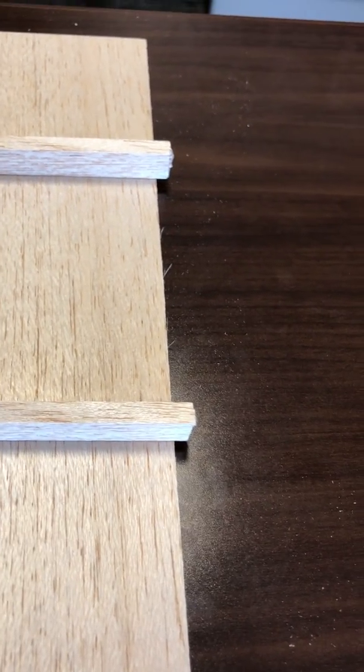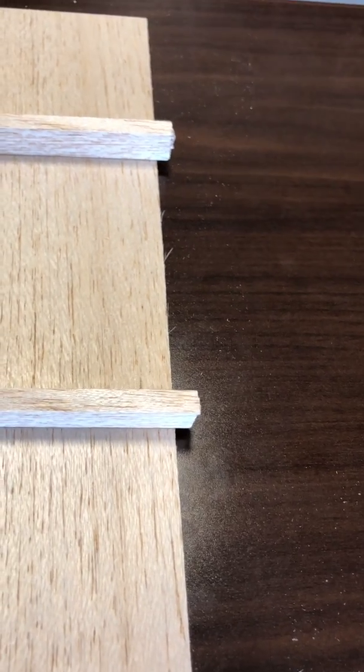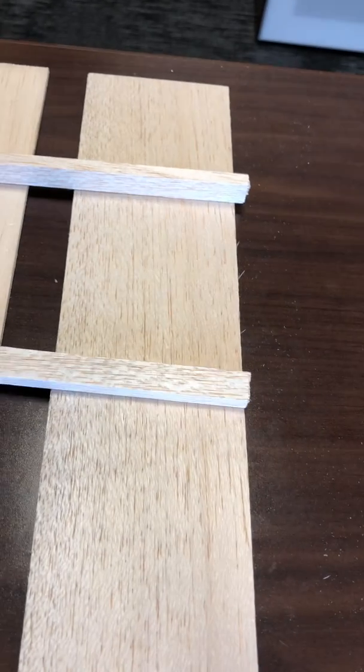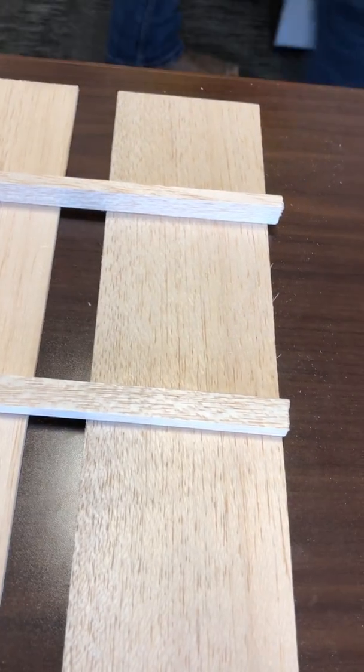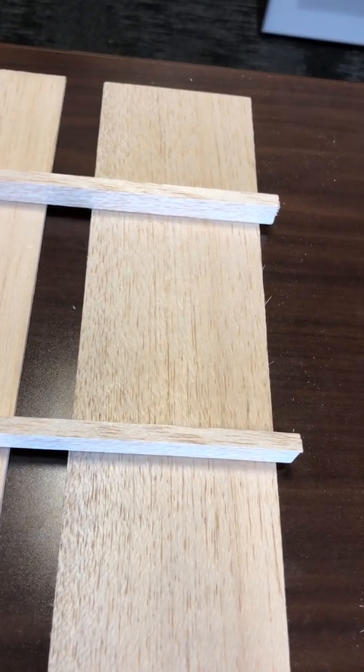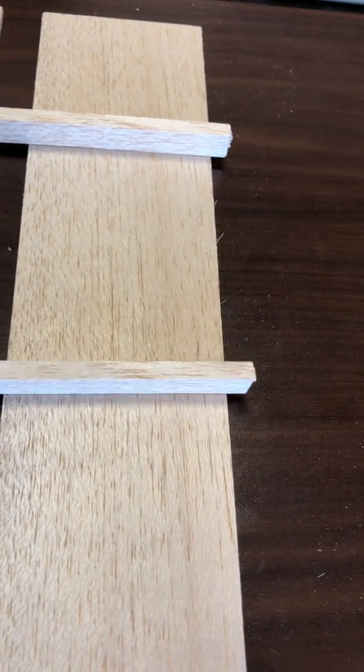Always make sure to have this longer — half an inch, quarter an inch, whatever you think is suitable for your design. If you use such members, do not lay them flat. You need to lay them on the edge side up so that they are stronger and can resist larger loads.